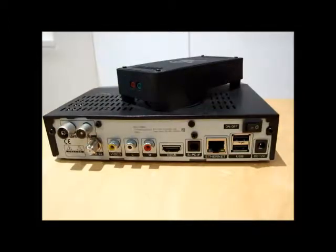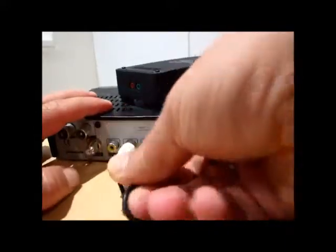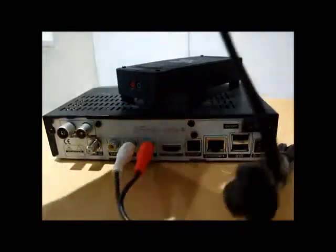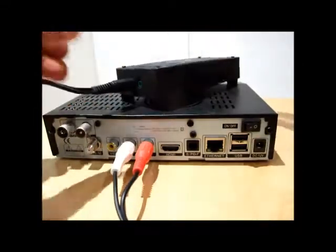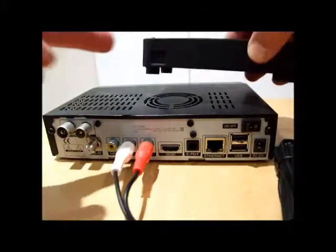Connecting the system up is very simple. You need to take analog audio from the RCA sockets at the back of a decoder and add them to the red audio input socket on the AudioZone server, and then simply add 5 volts of power.